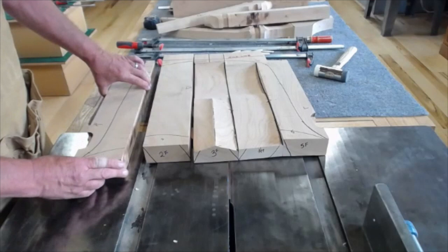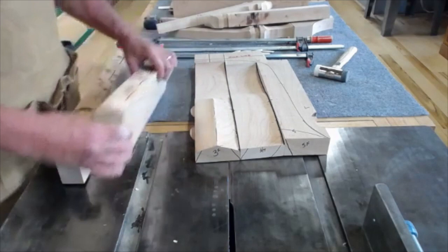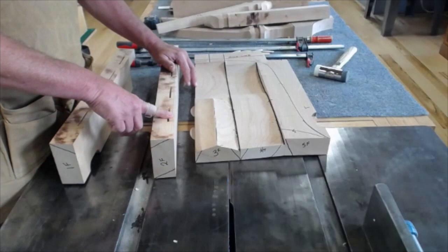So this angle, before I sculpted this, is an acute angle, and I can't get a good mark in there. And this is acute, and I can't get a good Domino cut here. So I use biscuits. The biscuiter for me is better on acute angles, where the Domino is good on obtuse angles. And therefore I use biscuits.